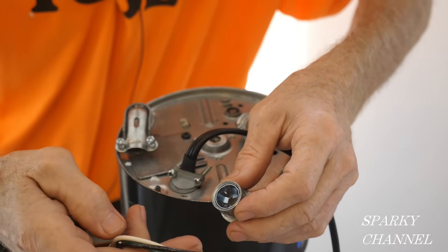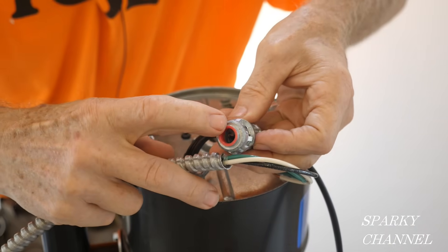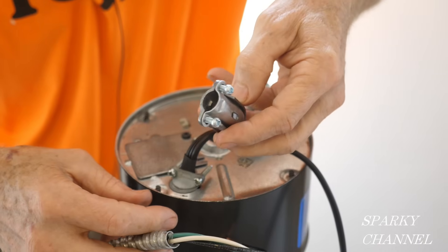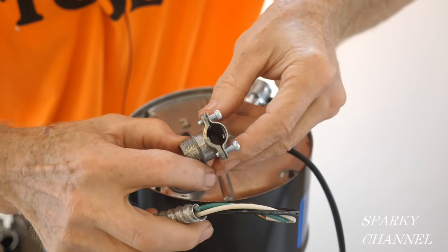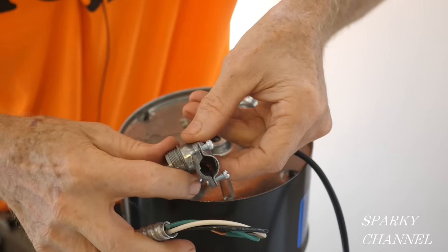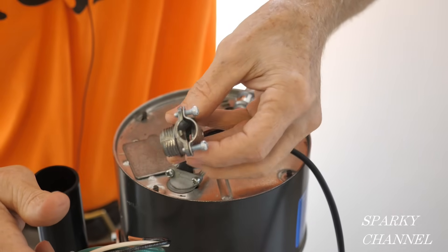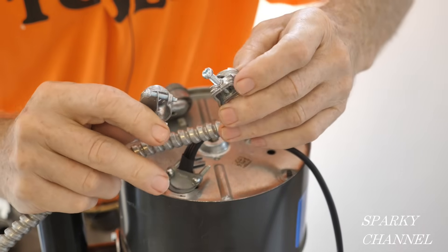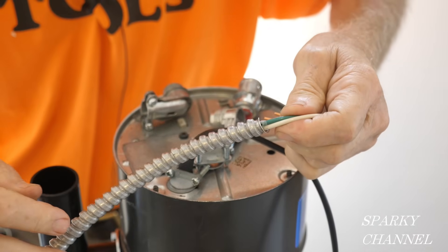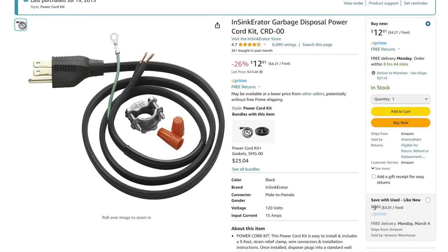Here's another type of cable connector — this portion clamps onto your metal cladding; that's a real nice cable clamp. This one here just pushes in quickly, but I don't think it gives as strong a connection to the metal cladding — though it does have a nice built-in redhead. This one is a right-angle connector for metal clad cable that gives a good connection, but it's kind of hard to work with because you have to get your wires through both pieces. My recommendation for cable clamps would be either the first type or the second type if you have metal clad cable coming from your wall in an older house.